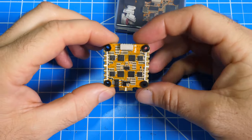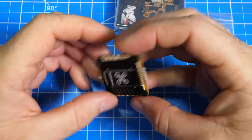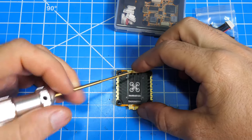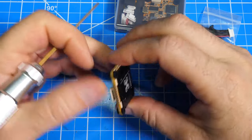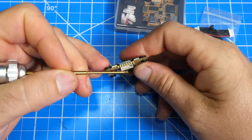And here I have the ESC itself — man, does it look good. The first thing that jumps out to me is how thick the PCB is; it'll definitely handle the advertised amperage. I also want to point out that the heatsink is made of metal, so it should disperse the heat really well. The ESC also has 4 RGB LEDs that are configurable directly in the BLHeli suite. And here's the connector for the flight controller harness.